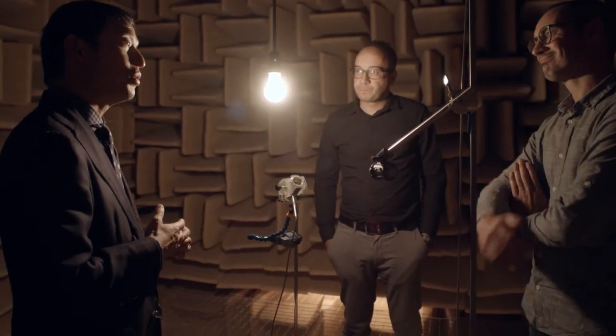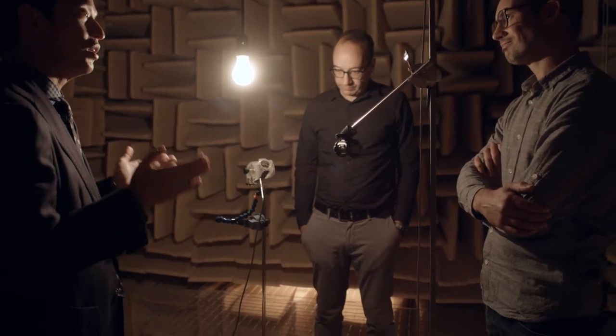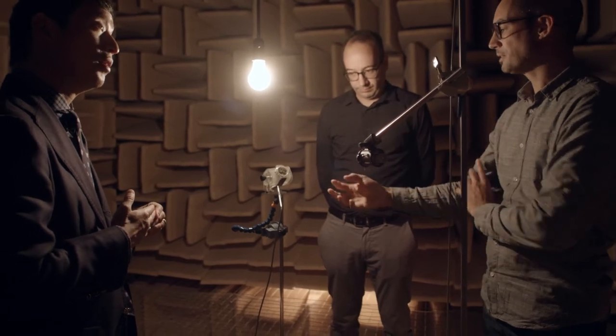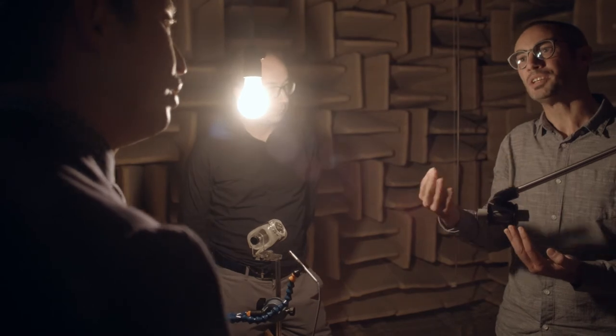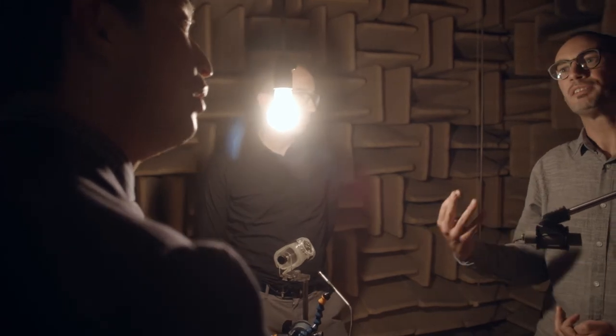Let's talk about what you measured for the sapphire gong full strike. What did you see immediately in terms of results compared to a metal gong watch? First, it's three times louder. This is because the transfer path from the hammer strike on the gong goes directly to the glass — there's no attenuation, no change of medium between the vibration and the ear. It's about 10 to 15 decibels more.